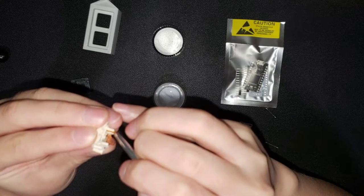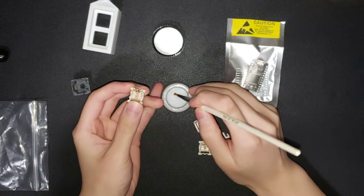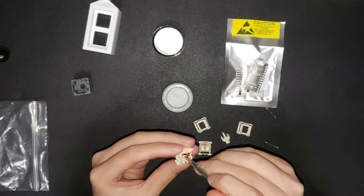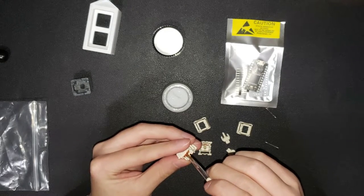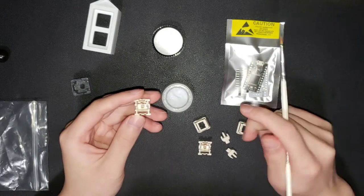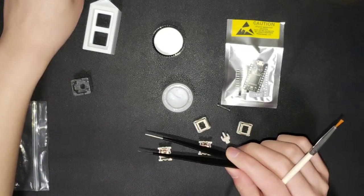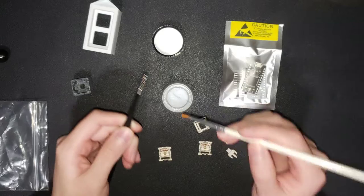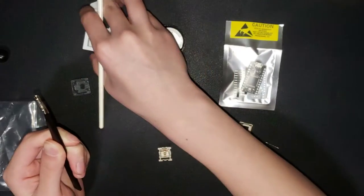Yeah, so I went ahead and looked up what the recommended build guide was, because there's a lot of pins on the Pro Micro and we don't use that much of it, because it's just 2 switches. There's no need for all those other input pins. So I think what I'm going to do is probably break off the headers and not use the whole thing. There's no point in soldering all of them anyways, and it proves to be a little bit more difficult since, like I said, no Mill-Max. So that means the soldering is going to be a little bit more difficult, as I'm going to have to solder while everything's here.